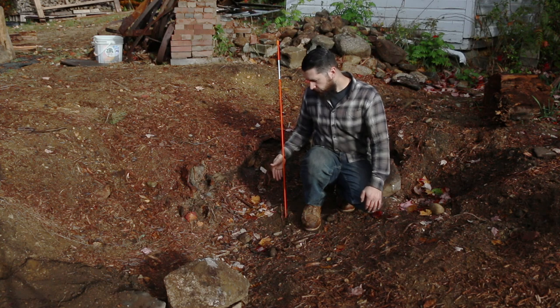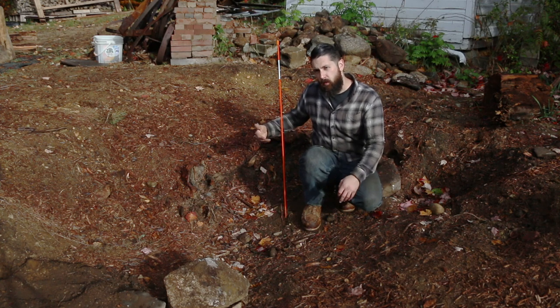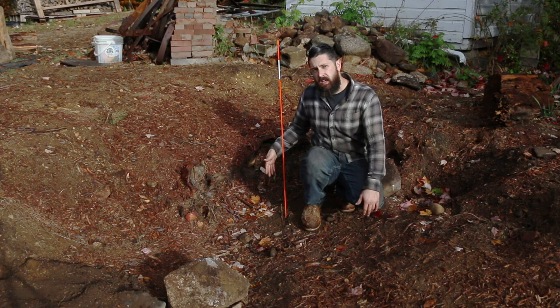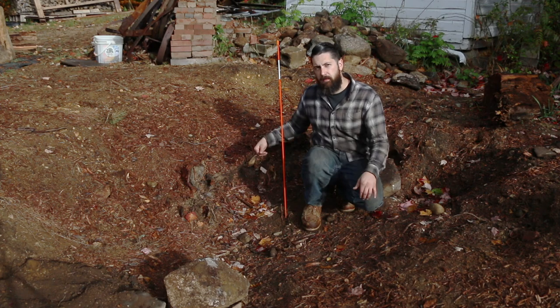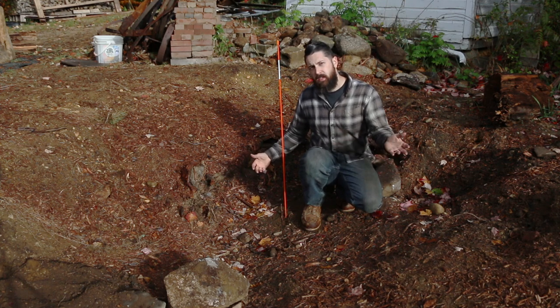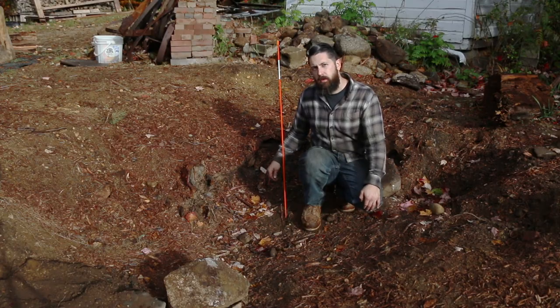Now luckily for us, having to excavate for getting out the rocks and taking out that big stump, we're a good deal of the way down here. We're supposed to be sitting these down about 4 feet. So from the ground here down is about 2 feet that we have to dig for this one, and then the rest will get backfilled in. Hopefully the rest go well, hopefully we don't hit too many rocks. And if we can get all 3 of these dug and put in today, hopefully tomorrow we can start trying to pour the cement.